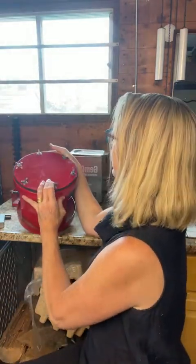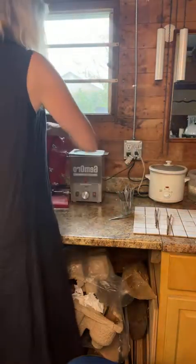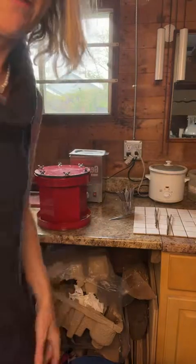So this is the tumbler, and it's full of stainless steel shot and water, and a bit of a burnishing compound, and it has these ridiculously many screws on top of it. And if you follow my stories, you would have seen me sometimes at the end of the night I put the finished pieces in there. As it rolls around, it tumbles, literally tumbles the pieces together with the stainless steel shot, and that hardens the metal from its annealed state. Again, this is very technical, but into a much harder metal and polishes it a little bit. It still needs polishing afterwards, and this just goes. You can see that when I lift it, it's quite heavy, and then it goes on here like that, and then I turn it on, and it goes around like that. And I oftentimes have this puppy go all night because it needs to be in there a long time.